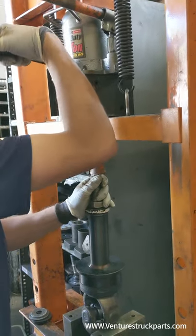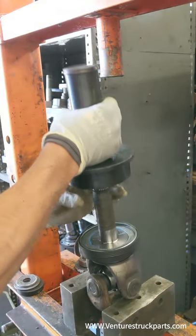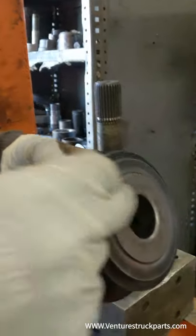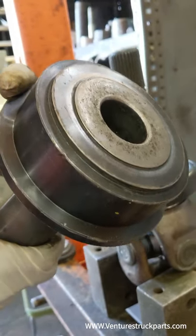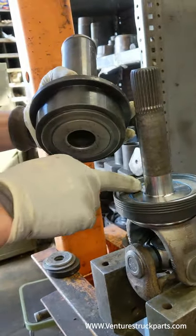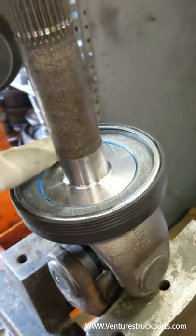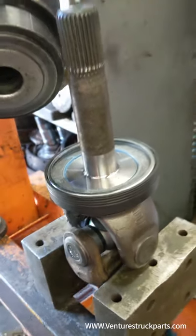I'll show you the design of the tool here. It's got this little ridge — you can see that — and that is for your thrust washer. So when you press down, this bottoms out on the surface of your shaft and it leaves your seal just up a little bit. It leaves that recess there so your thrust washer can sit in there.